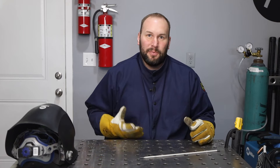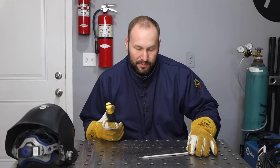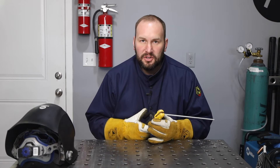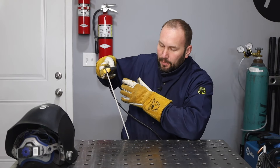You may be thinking, that's great Tim, but I've got to keep a short arc length — how do I actually do it in practice? Well, it is easier said than done, like most things. It comes down to quite a bit of practice and arc time working through exercises, especially padding beads on plate like we do in my online course. A few practical tips: propping and support.